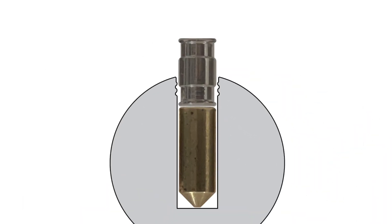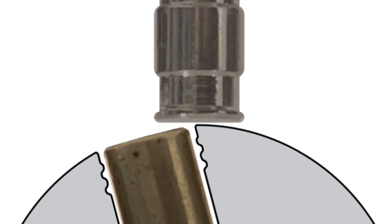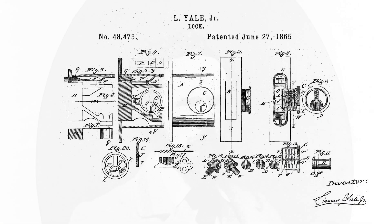In this video, we will learn about the two phases necessary to pick the barrel driver with its matching serrated countermilling. The modern pin tumbler lock is credited to Linus Yale Jr. and his original 1865 patent. A little-known but fascinating fact is that in this patent, Yale describes the first pin chamber modification to thwart lockpicking — threaded key pins and driver pins with matching threaded pin chambers.